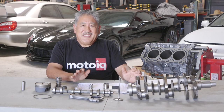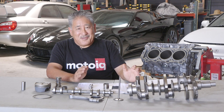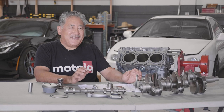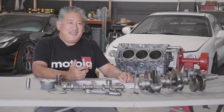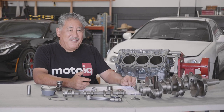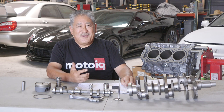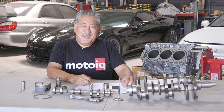So far I've been talking about just engine parts. It's safe to say that an engine that has been completely WPC treated will generally have almost twice the service life of a non-WPC-treated engine. But engines aren't the only spot where you can use WPC — we use it on ring-and-pinions, transmission gears, shafts, axle stub shafts, and CV joints. Anywhere where heat, wear, and strength are a problem, it works really well in the drivetrain.